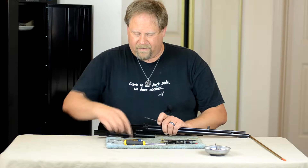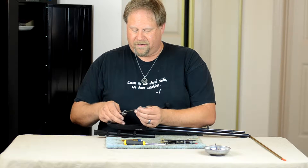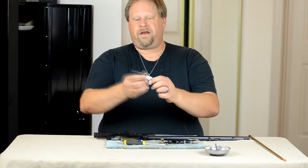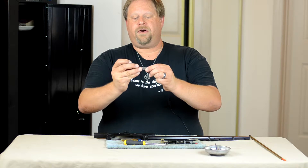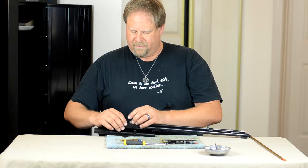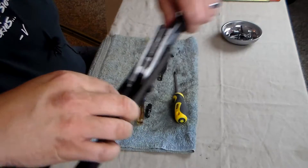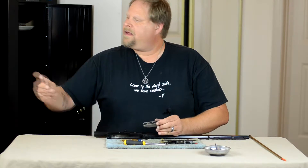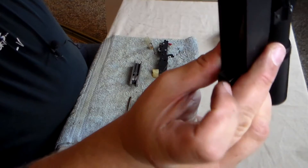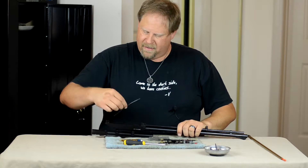This is where the fun part comes in, because you have to get your bolt down inside without bending your spring or your pin. The idea is you're going to put your spring with the pin back here and push it inside the bolt while it's inside here — this part can be kind of challenging. What I'm doing is laying the pin into the notch. There's a little pointy head here — that little pointy head right there is going to go down inside. There's a little notch down in there, and that's going to sit in there.